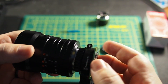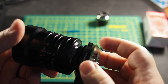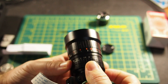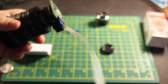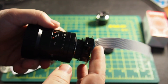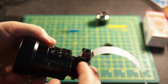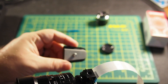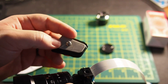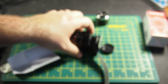You have to really wrench the screw down to get it to stop moving — it feels like you're going to break it, which is kind of annoying. Some lenses also have aperture control, which you can actually control now. The camera has a ribbon cable for you to connect to the Pi, and it also has a tripod mount, which lets you connect any tripod plate with a quarter-inch 20 connection. And that's really it — you just set it up like any other Raspberry Pi camera.